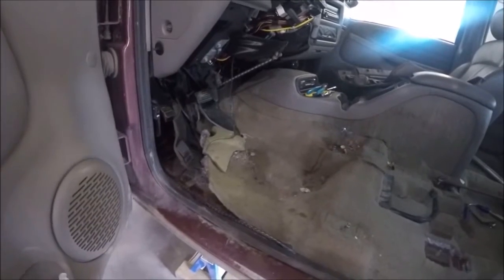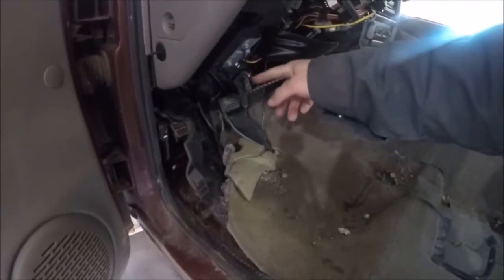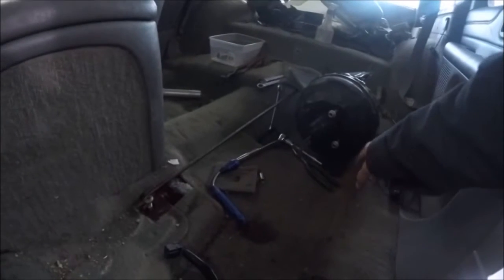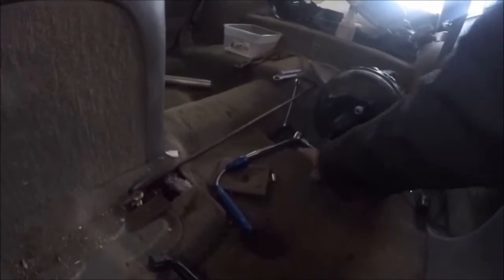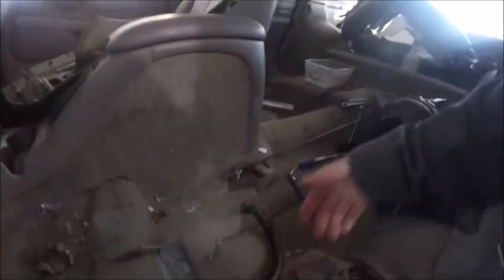And at idle, it shouldn't matter. There's so much resistance with the tracked system that idling it won't move. You need to give it some gas to get it to move, I think. So I think it should be okay. Anyways, gonna remove the brake pedal. I'm gonna take the other master cylinder out, and then the first step is to fabricate a bracket that runs off the seat post. So you can see we got some plates started here.